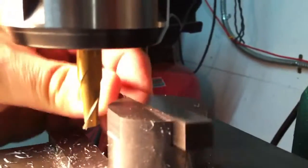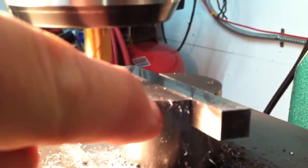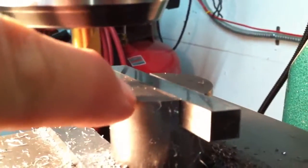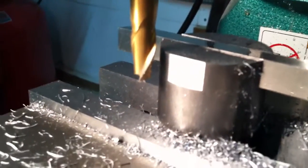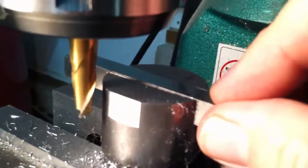Just a little bit of movement, but the cutter will fit in there. This area right here — I'm going to be putting three set screws. So I need to flatten this front part out so I can tap three set screws to hold this piece here.